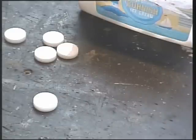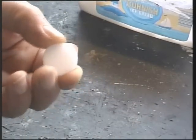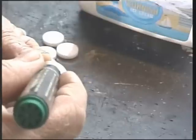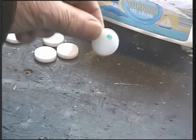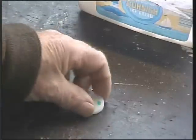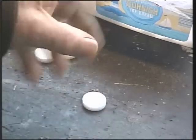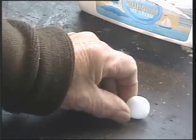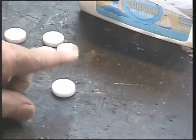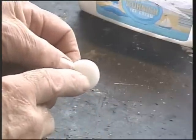My targets are designed specifically for my needs. And I've looked at other, let's get in shot, I've looked at other reactive chalk targets, and there's one mate that's got a little tiny hole about there. And the idea being you could hang it on a paper clip, a pin, whatever. My system wasn't going to be hung up like that. And in fact, what I had thoughts on was a hopper with loads of these in. Well, not these, but the chalk ones, obviously. And auto-fed down a system. That was the idea, so I'd had no need for the hole. But while I'm making this plug, I thought, well, I'd be silly not to incorporate that in there. Because once it's in the plug, and therefore in the mould, they would be produced all the time. So I've decided to incorporate a tapered hole at that point.